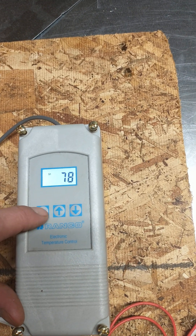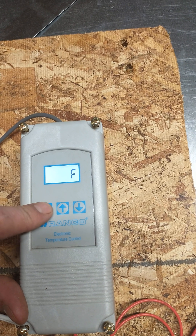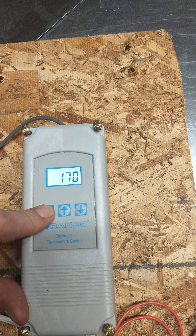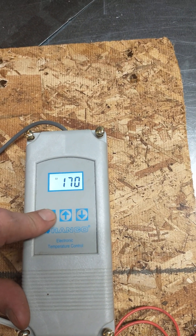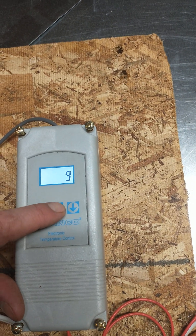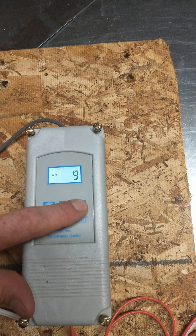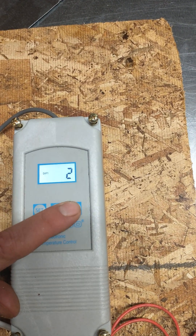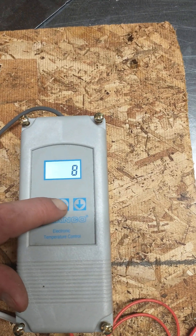That second set is your set point. It toggles back every 30 seconds to the water temperature. So it's Fahrenheit, then your cutoff temperature. I would not run that lower than 160 — it'll start getting some condensation in the stove and it'll sweat. Set again shows 10 — the differential — and you can adjust that up or down with the arrows. I usually run that at 10 in the wintertime. Summertime, if you're just running for hot water, sometimes you have to back it off to 2 or 3 degrees to make it run a short cycle to help keep the fire lit, though it's not as efficient running that way.